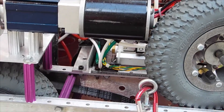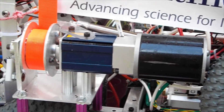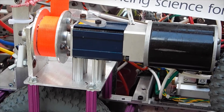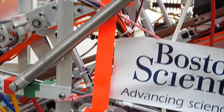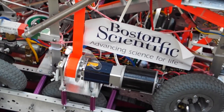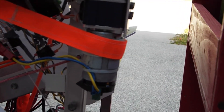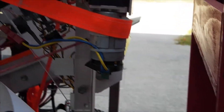Here's another motor on the side of the robot. This little black cylinder is similar to the CIM motor but shorter — it's called a mini CIM. It has about two-thirds the power of a CIM and about two-thirds the size. It's tied to a bluish gearbox, which I believe is a 64-to-1 gearbox, and it's connected to a strap that pulls the whole strap in.